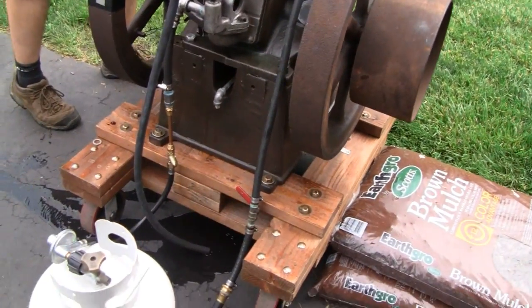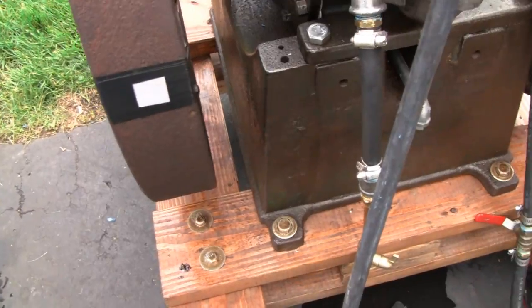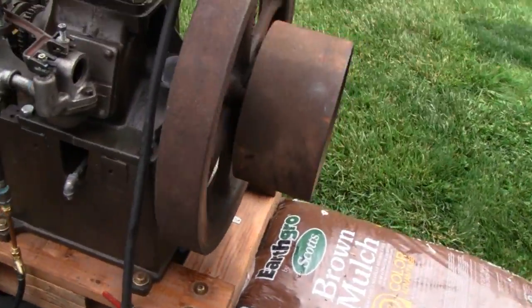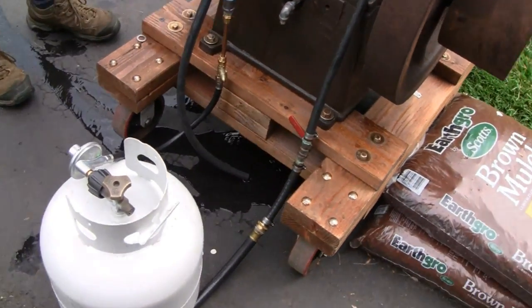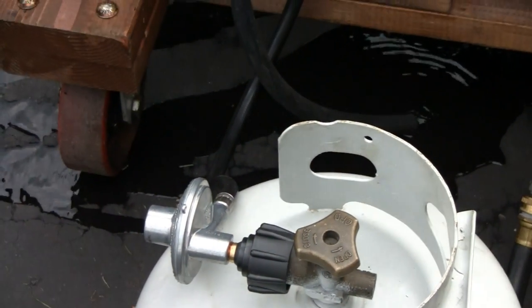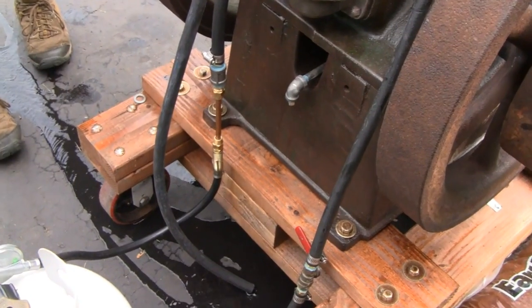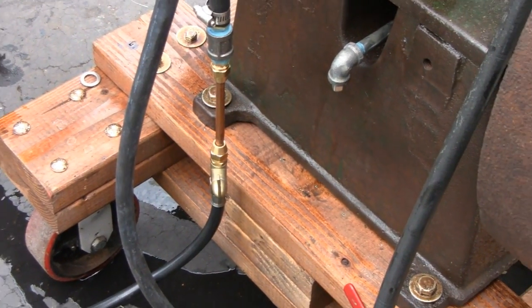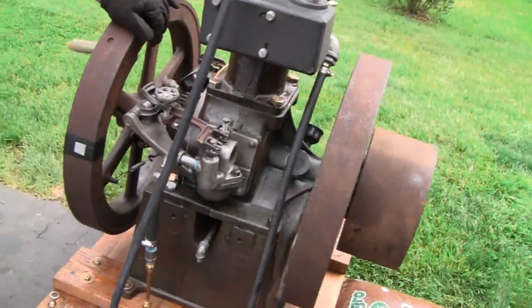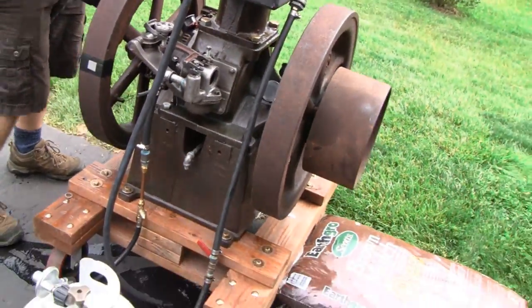Mike did a little fine-tuning here. There's not much he can do with this because the regulator only goes so high. We're going to check the RPM — he put a little piece of reflective tape because he has this digital tachometer, and we're going to see how fast it was going. Did you adjust that? I did, I just backed it off a little bit. Mike, you can't really adjust that much because this regulator is only going to put out one PSI and not very much volume. That's why it would get a little backfire. I have this valve here and it's wide open right now — if I try to cut that even a little bit, the engine just cuts right out. Then you need a bigger regulator and an accumulator type so I can better control it. Let's see how many RPM this thing was doing. He put a little plastic coating handle on here so he wouldn't rip his hand apart — just to help a little bit. Alright, we're going to try it. Go for it, buddy.